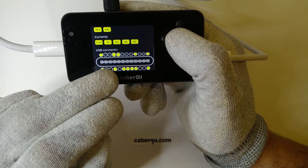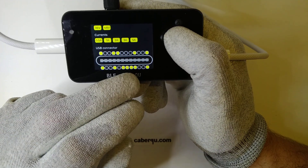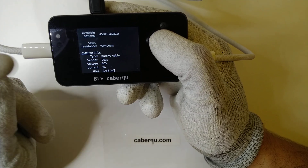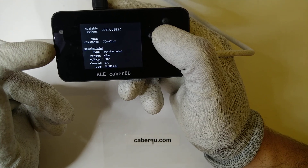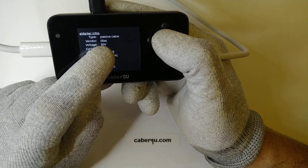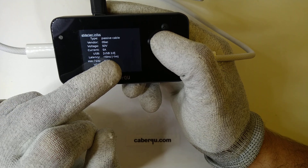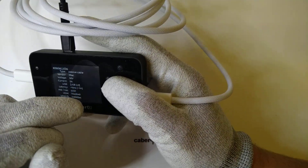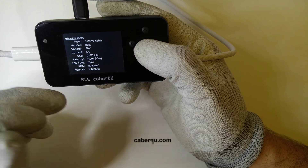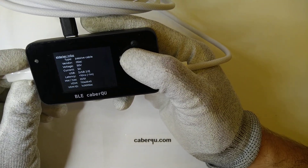The connector pinout is the same as the last cable. The pins required for USB 3 and 4 and sideband units are not connected — only D-plus and D-minus for USB 2 compatibility. The VBUS resistance is a bit lower at 70 milliohms, so it's a bit newer with slightly better connections — no dirt or rust. The vendor ID is again 05AC, so it's an Apple cable. This one reports 10 nanoseconds latency, specifying itself as 1 meter or below, but I know it's actually 2 meters, so I'm not sure if they measured it themselves or approximated. It's at hardware version 01 and software version 01.